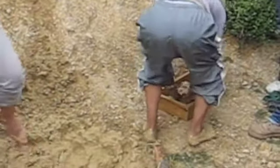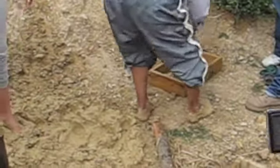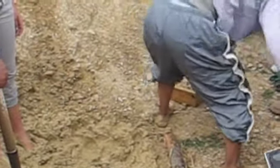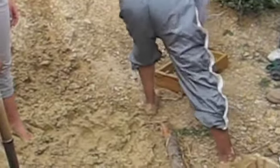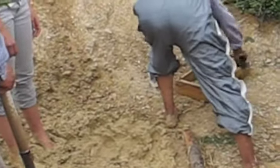The mixture is done and ready to be dropped into the cast. The man takes the clay by hand and presses it down, ensuring the solidity of the blocks. It's important to verify that the wooden cast is wet to avoid any problems later when taking the frames out.